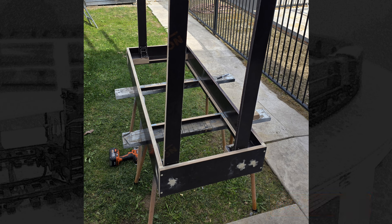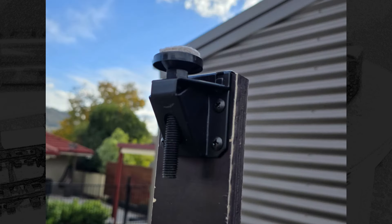You can see how each side of the legs offsets the other, which is why there were different sizes of those blocks. For each of the legs I had to have adjustable feet — I found these on Amazon as well and they're pretty decent. They have a lip on the bottom that supports the weight of the leg, so not everything is weighing against the screws into the wood. I've got about 50mm to 70mm of adjustment, and I also put felt feet on the bottom.